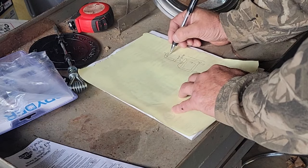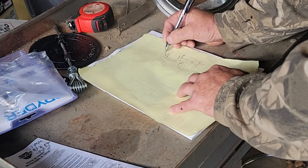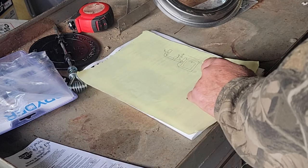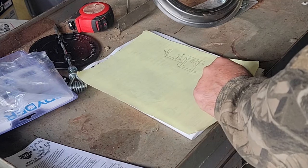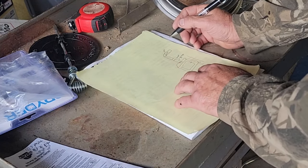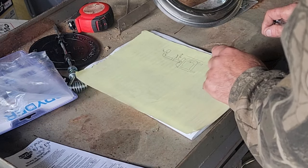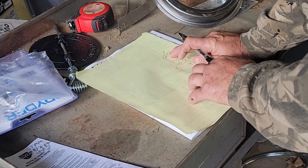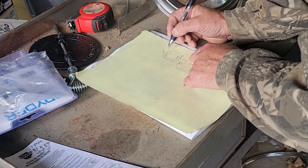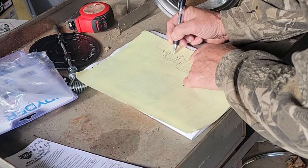This six-inch is going to end up being 24 inches long — a six-by-24. The wall is a two-by-four, half-inch plywood inside, half-inch plywood outside, three-quarter-inch tongue-and-groove cedar on the outside. So we're going to have about a seven-inch wall. I'm going to do drywall on top of that, then a spacer, so I need somewhere about 19 to 20 inches. I'm going to use a 24-inch pipe. Right here is where the wall is going to be. In here is the collar — a two-piece collar. The outside diameter is 13-inch, and the inside is about seven and a half or close to eight inches for the insulated pipe.